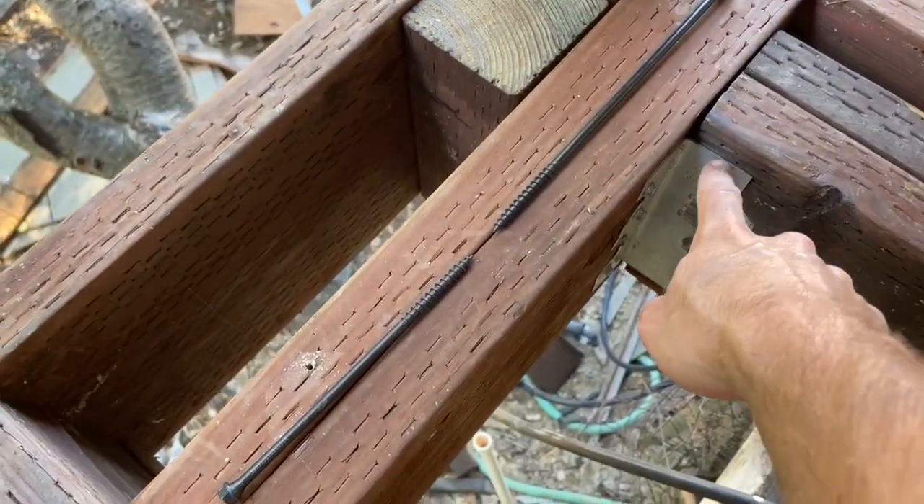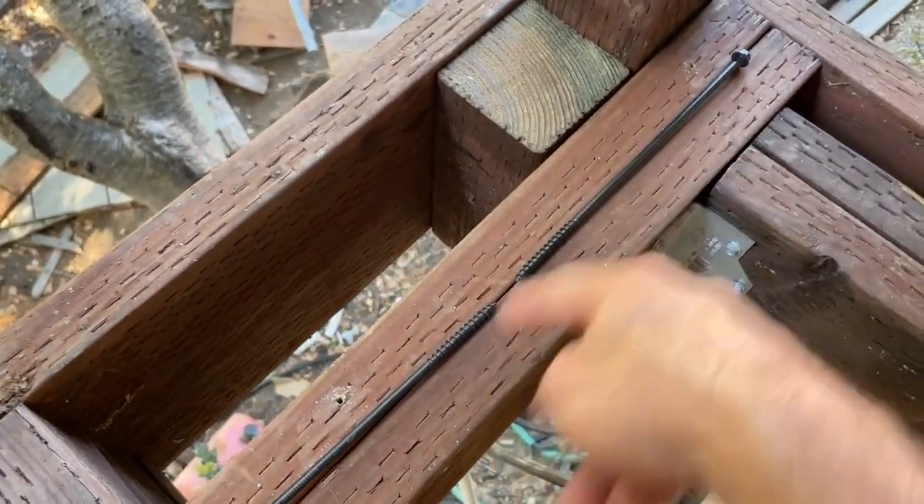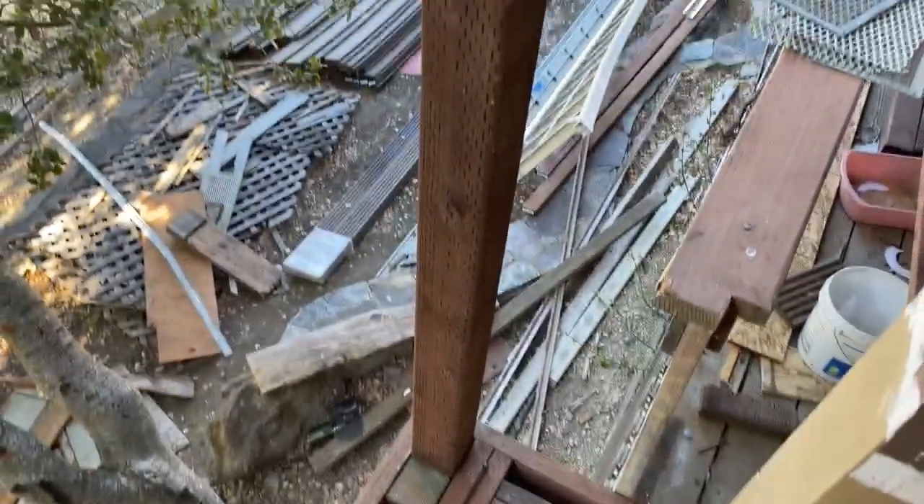In my case because I'm doing picture framing, I'm using an L70 or an L90 here to support the deck boards after I installed the blocking, but that is the final product for a corner post.